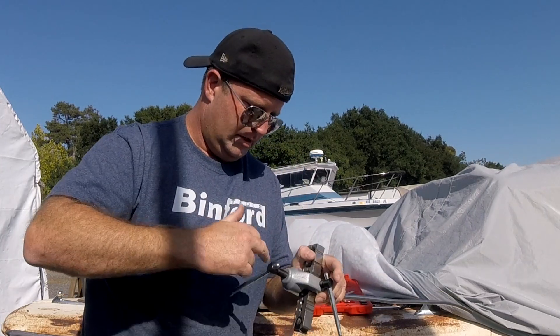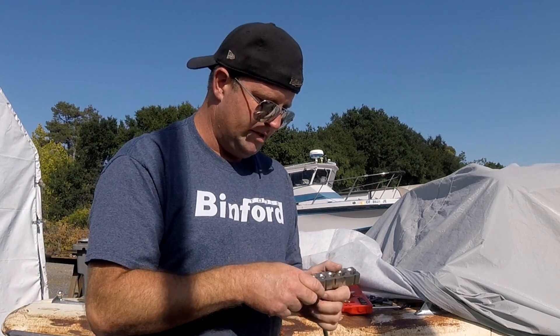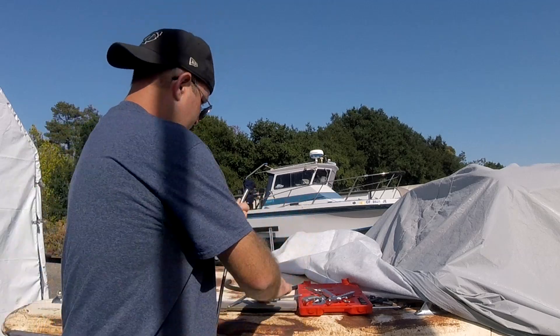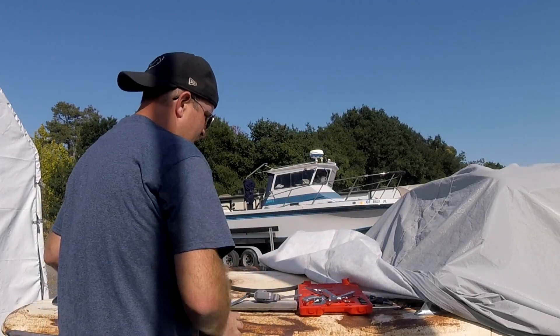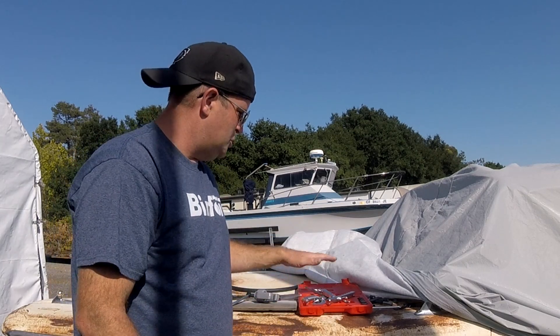This is more of just a comparison between the tools and not so much a how-to. There you go — you can see that created a nice little flare on the end of that. This is the case of spending twice as many dollars, but a few more dollars on a good name-brand tool like Rigid works properly. The cheap generic Amazon stuff doesn't work so much — at least not with stainless steel, not three-eighths stainless steel. I'll link both down in the description so you can see which one not to get. Hope you guys got something out of that — until next time, be excellent to each other.